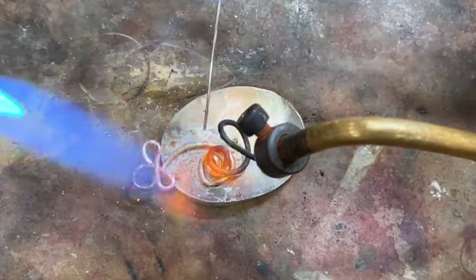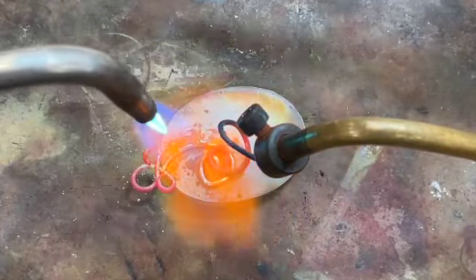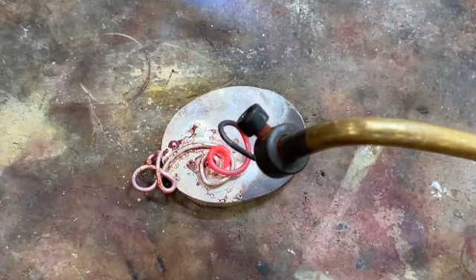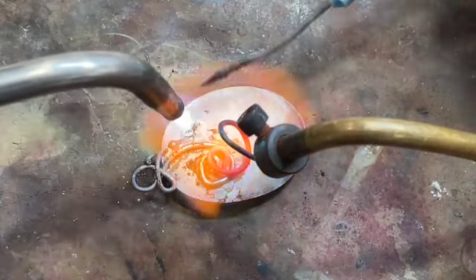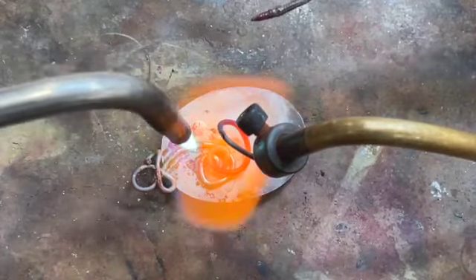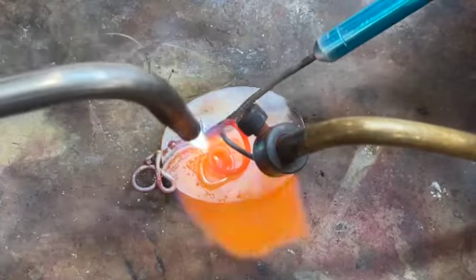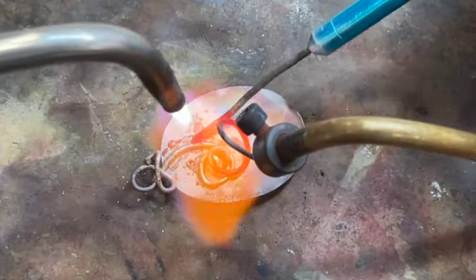It's just a hair — a little hot. We're going to set some solder here and try to get it to make contact with the base plate, and that will actually melt and flow. Our steel does act as a heat sink a little bit, but the solder will still heat up and flow. As you move it around, you're moving the silver solder around. I'm just going to swipe and clean that little goober up — come over here a little more and get most of that off.